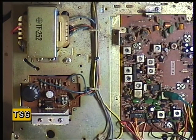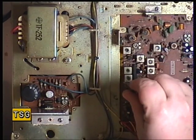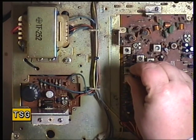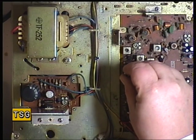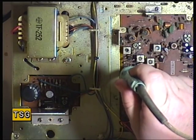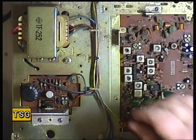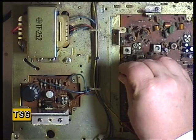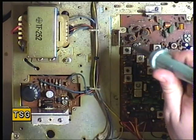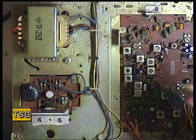I'm doing all this on channel 40 — I should reset it to channel 20. Start again: L16, L15 — that's tightened itself back up again. Yes, I was doing the VCO on channel 14. Failed to reset it. So we'll skip the one with the damaged core at the moment and go over to L12.